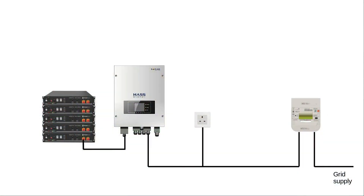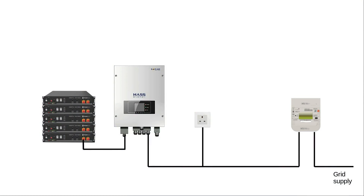Here's your typical setup: you have your battery storage inverter connected to a big stack of batteries, also connected to the AC supply in your home. An AC coupled battery storage system will almost certainly have one or more of these - this is a CT clamp, or current transformer. Exactly how these work is beyond the scope of this video, but they rely on the electromagnetic effect, and with this clamped around one of the incoming tails to your house, it's possible to tell how much power is going through the wire.